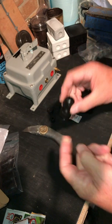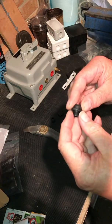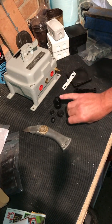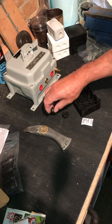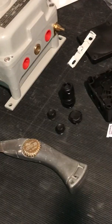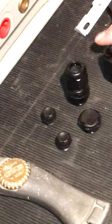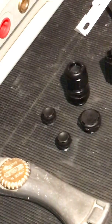So we have: vent gland M20, vent plug M20 Wiska, and Wiska M12 — all three excellent products from Wiska. Give yourself some options — don't put a 3mm hole in the bottom of the box and expect everything to be okay, it's not likely to be. These will work nicely to ensure that your boxes stay nice and dry. There you go guys, another excellent offering from Wiska. Thanks very much and stay safe.